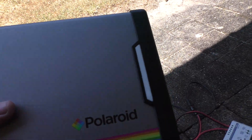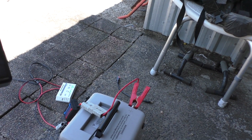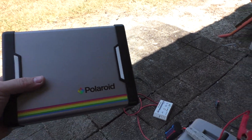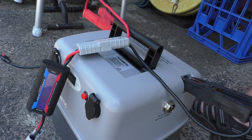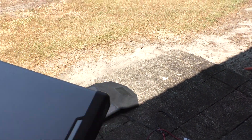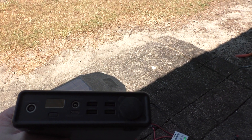Reading around 30 watts, 30-plus watts — it might be about 11 o'clock so the sun's up. It's a lithium battery, very light, putting out a similar amp-hour or usable amp-hours to a bigger battery, because you can take the lithium down to 80 percent where AGM batteries you can only take down to 50 percent before you start deteriorating them more than you want. So you probably get around 20 usable amp-hours out of this battery taking it down to 80 percent.